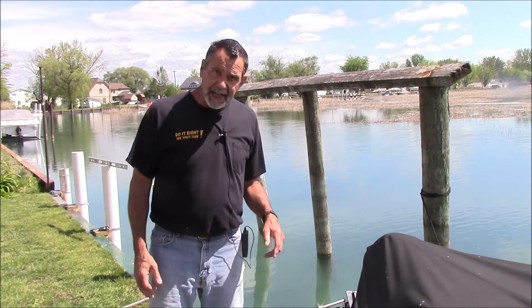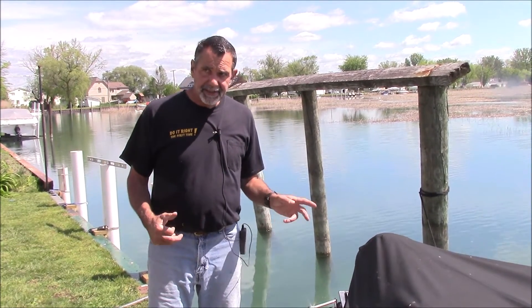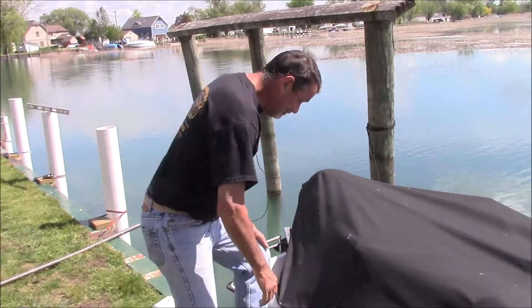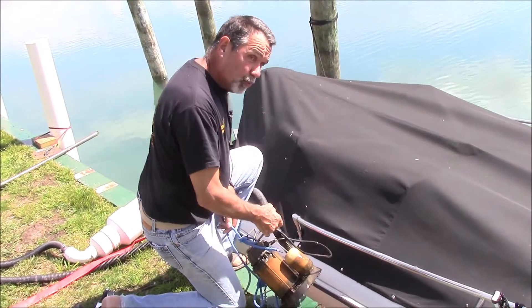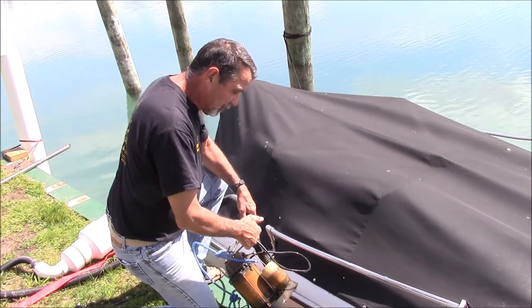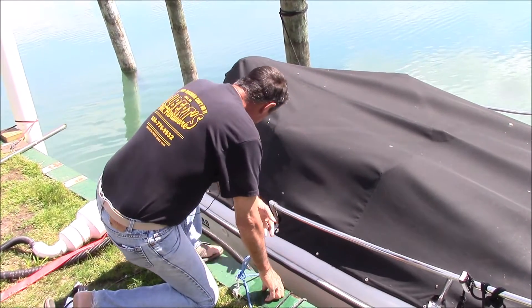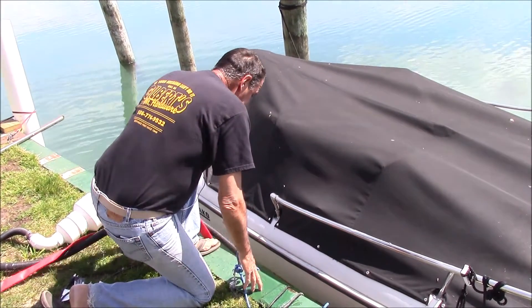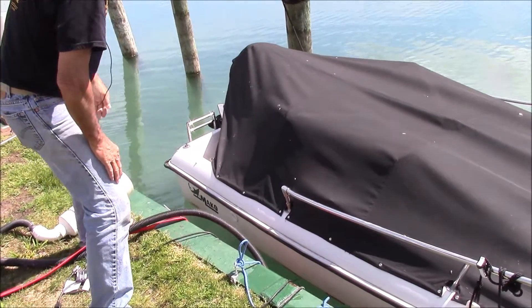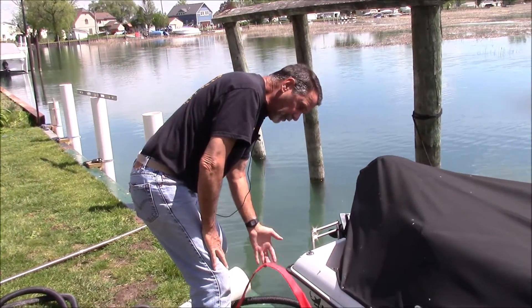In order to jet a piling or piece of PVC into the lake bottom, you need a pump — you don't need an expensive pump, just a plain old one-third horsepower sump pump with flexible hose. I have another pump down here too, so I'm using stuff I have on hand. One pump uses a standard sump pump hose; the other is just using a flat roll-up fire hose.